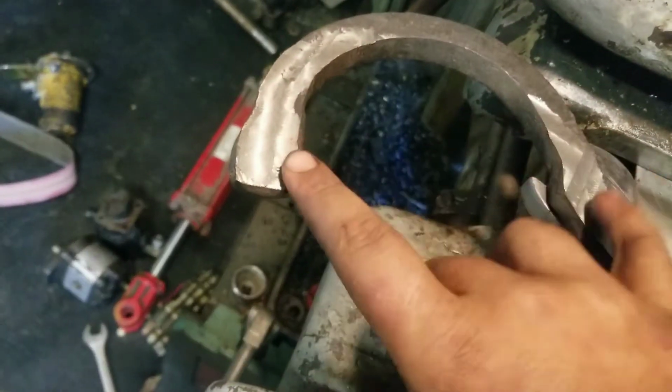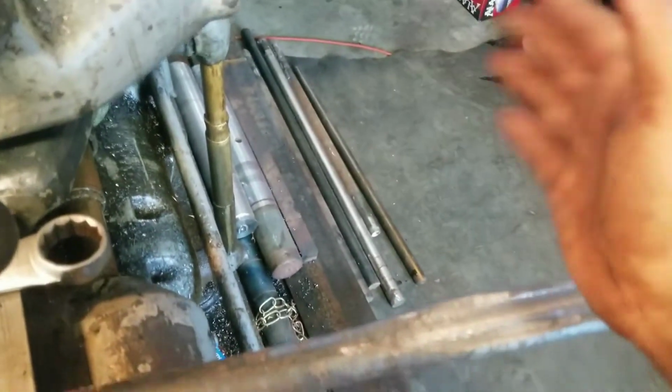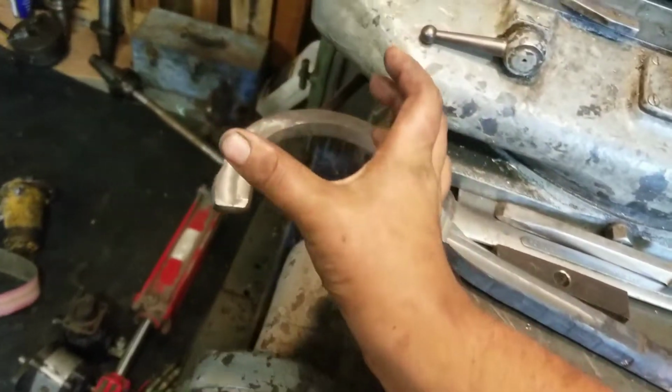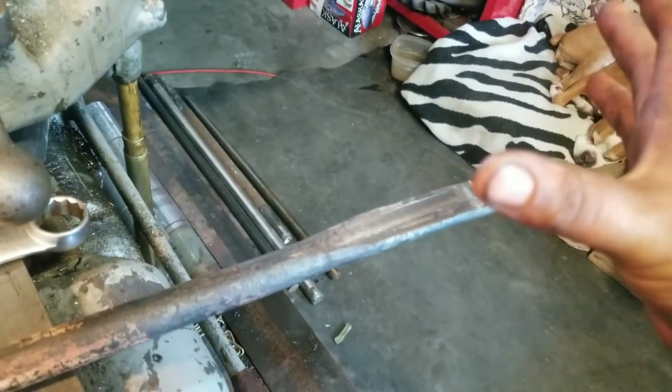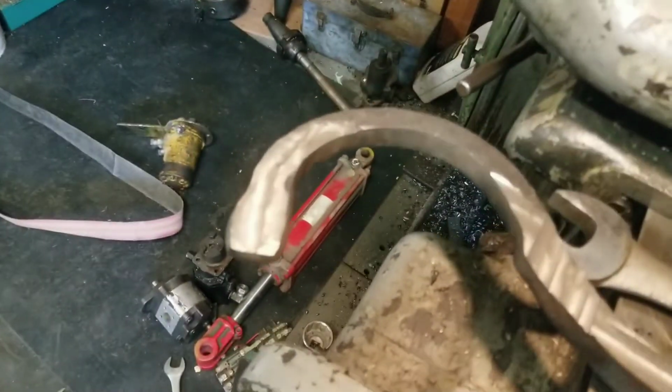But all I have to do is drill these holes. I'm going to weld on a mount for my tire. That's the tire down there that I'm going to use. And the rest is pretty simple. The center to center distance between a 3-inch drive wheel and the 10-inch idler is 25 inches. And that 25 inches is about here, so I am going to cut off a chunk. This will get welded to a stand. The motor will be at the bottom, wheel on the top.